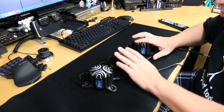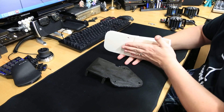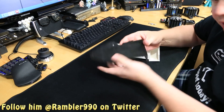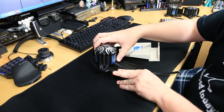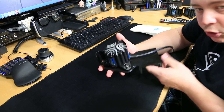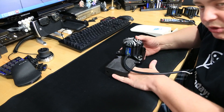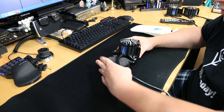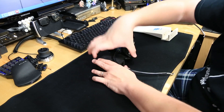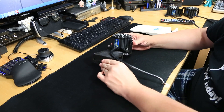We ran into a couple of snags, but we've worked those out, so now we're getting back on it. If you watched the old video, you can see these are the brackets that we came up with. A guy named John Alves, one of my followers, actually modeled these. This is the rear bracket for the simulator, and you can see the LFE sits right on top here. You just put a couple of bolts through it. You can see the transducers mounted to it, and it basically goes over the little armature on the simulator and bolts to that also. We found this design to be kind of inefficient, because it puts the transducer out over the side instead of directly over the bar. We want the most of that vibration to go into the bar on the simulator. That was the problem we had with the front mount.